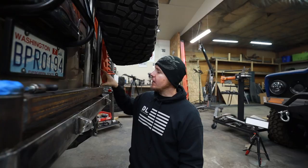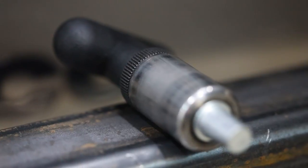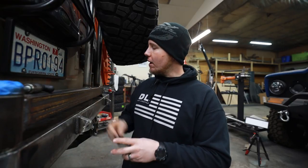Then I'm going to put a center plate in here, build it out of some eighth-inch steel, pop some holes in it, do some dimple dies, and put a little 90-degree kink on top — that's going to add a little more strength and a little more surface area. Mostly it's just going to add looks and not cost a whole bunch of weight. I bet the plate itself will be like a pound once we cut all the material away and bend it how we want it. Right after that, we're going to make a lock that's going to lock this open, so while I'm off-road, if the wind starts to blow a little bit or if we're on a slight hill, this thing doesn't want to swing shut on me — these are bearings after all.